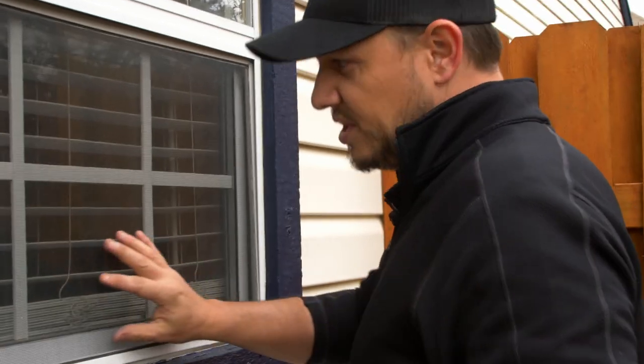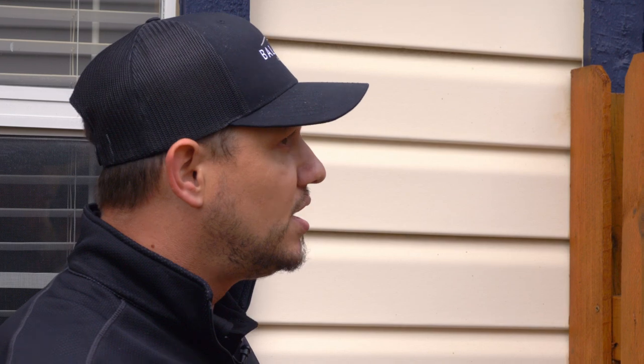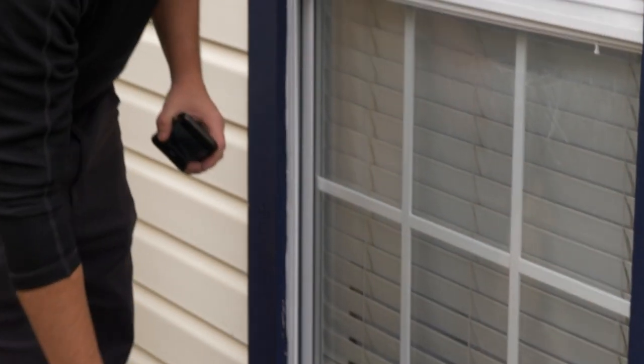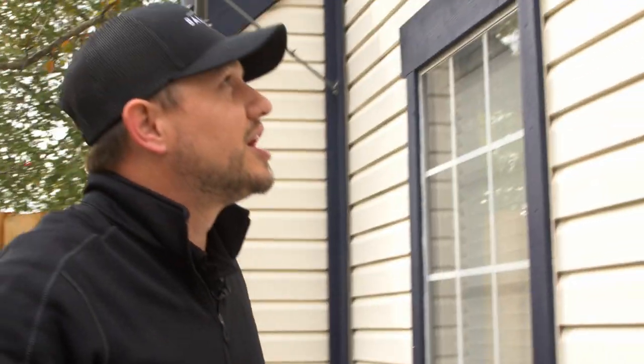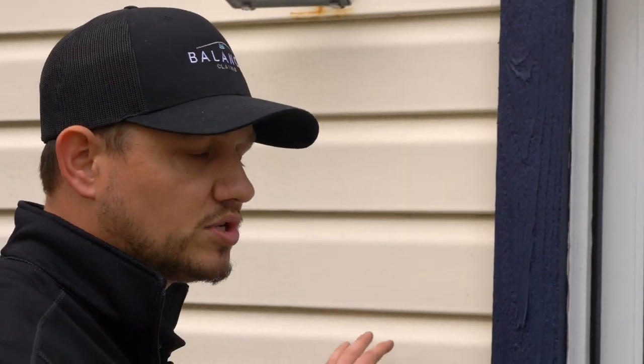This window screen looks good — no tears, no sags, no bows, no dents in the metal. Moving on, we're going to check out other structures on this house: fences, patios, and AC units. On wood fences, you're looking for fresh hits — anything that buried into the wood, left a dent, removed paint or stain. This fence is in really good condition, still looking brand new. The hail on this house looks to have been enough to damage soft metals, but thicker metals and vinyl siding don't appear to be affected, so we'll focus on soft metals and soft metal collateral damage.